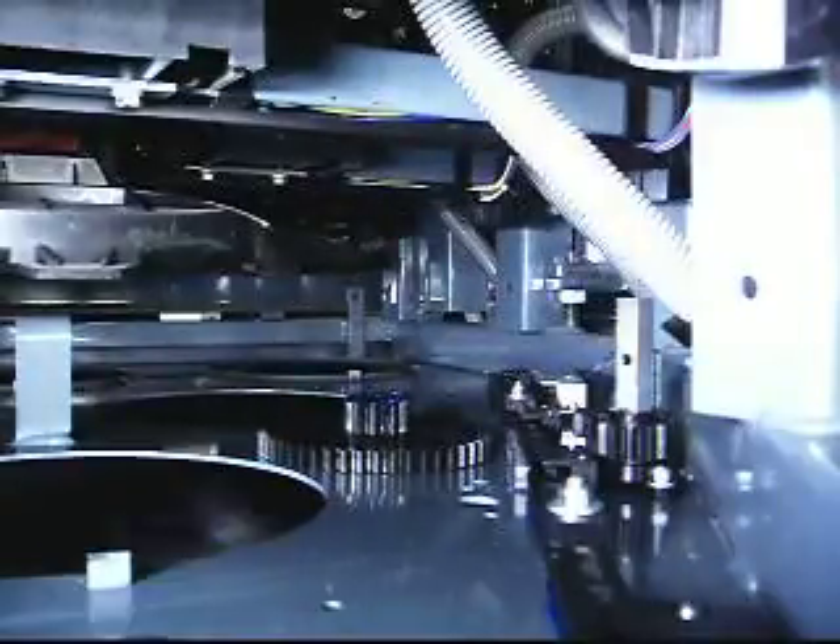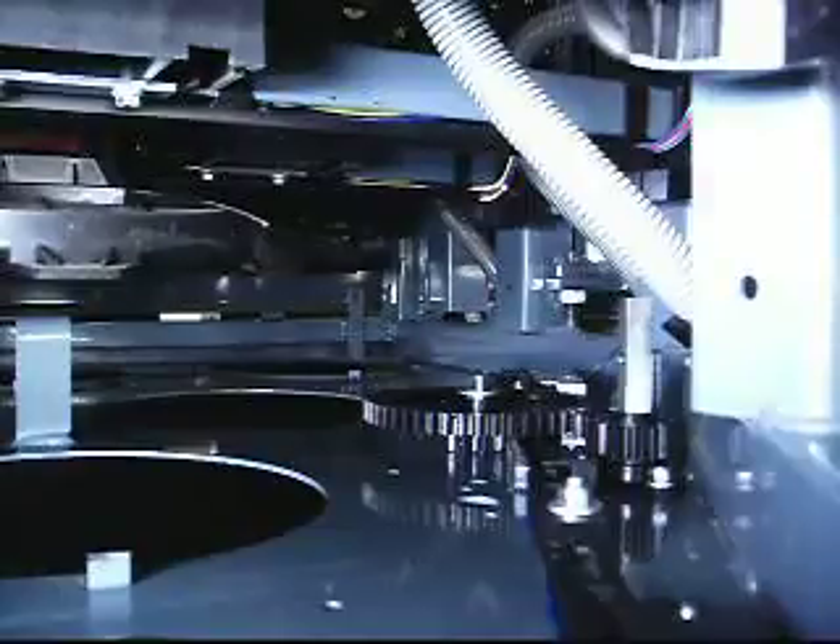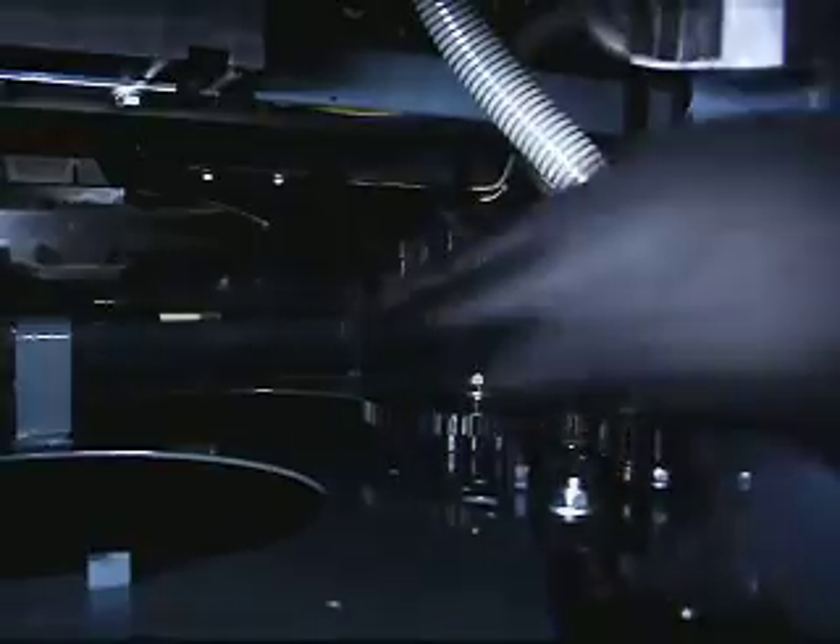Now it's time to throw in the big geared wheel, which has the lubricant on it as well. Come in from the bottom, set the big geared wheel down on top of it. Get the large bushing, wipe it down there. Washer, large washer, and another number 13 metric lock nut on the top. Now let's tighten that down.